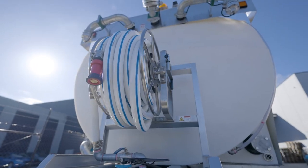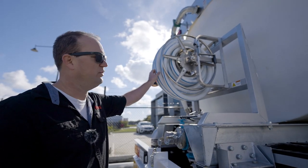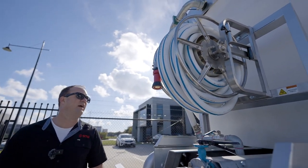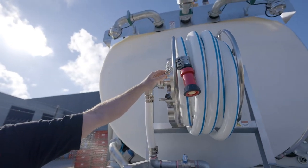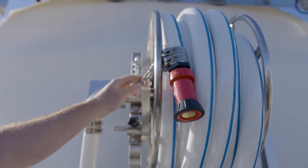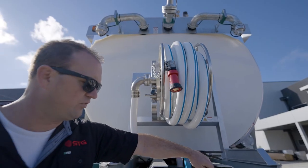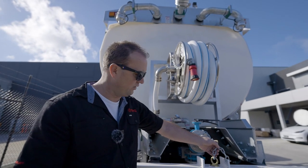At the back of the vehicle, check the condition of our hose — it will get pulled out onto the ground, so is it in good condition? Making sure our nozzles are good and that the chain is secure on this side. If this tries to unravel itself, it's all chained and secured. We don't want to be driving along the road with the hose wound out at the back, so daily checks — make sure all our chains are on our caps and everything is secure.